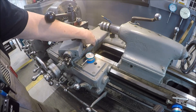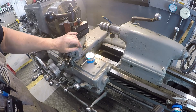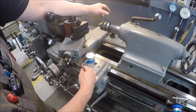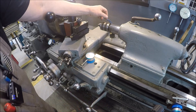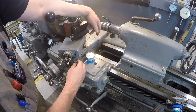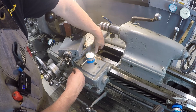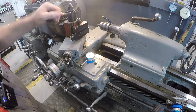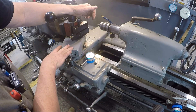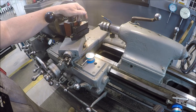What I'm going to do is make a bracket using the already existing threading holes in the side of the cross slide, so we don't have to drill anything. I'll make it adjustable so this stop back here I can move where I need it, and basically the dial travel indicator doesn't have to go anywhere — it'll be stationary. I'm thinking some sort of a dovetail rail and maybe a locking thumb screw so I can slide it out, get it where I need it, and lock it in. The only thing to deal with is this radius where the compound sits, and we have to make it low enough to clear everything.